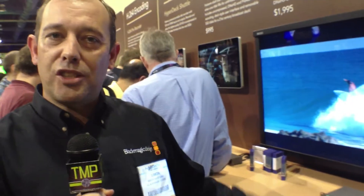In addition to the Hyperdeck Studio features, this now adds analog video connections — analog in and out — you also get analog audio, timecode on XLR. The most fantastic thing is it's got four channels of 3G SDI, so this is prepared for high bandwidth video formats.